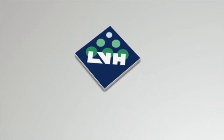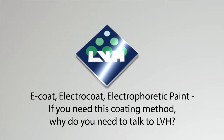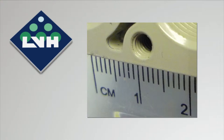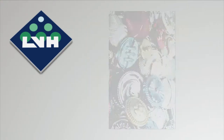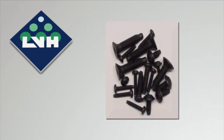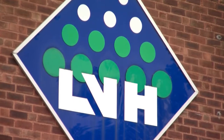The electrophoretic painting method, also known as e-coating and electrocoating, is a method of applying paint type coatings over electrically conductive surfaces. Its application method makes it very suitable for painting complex shaped items. Even fine detail in the millimetre size range and smaller can be coated consistently with controlled thickness. This precision coating technique provides advanced decorative, performance and functional capabilities.